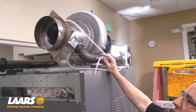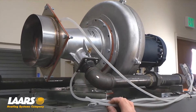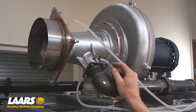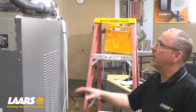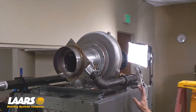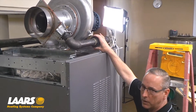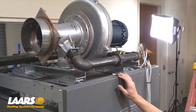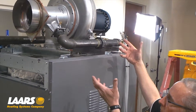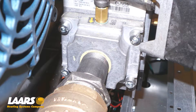Next, we're going to remove the reference tubes to the Venturi. These are vinyl, and we've marked them so we know which tube goes where. Note that current production uses aluminum tubing on the gas line, so please mark your references before removing these reference tubes. With the upper gas train disconnected and the braces that hold it in place, you can take this all out as one piece. This is a 2 million BTU boiler — we have a union here, and the 1.6 and 4 million will also have unions. The 3 million and 2.5 do not have a union here. There are two ways: you can take it out as one gas train, or on the gas valve there are block unions — take the four Allen screws off, the union will separate from the gas valve, and you can take it apart in two pieces.